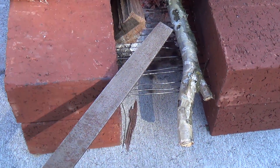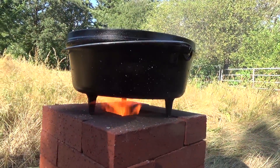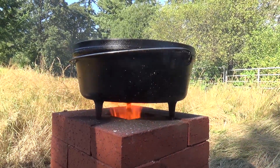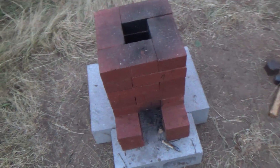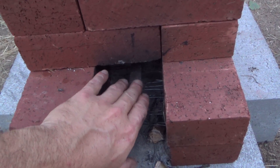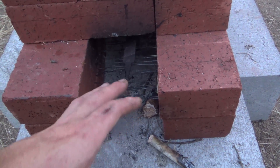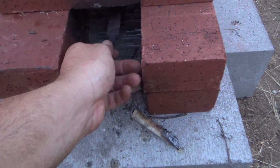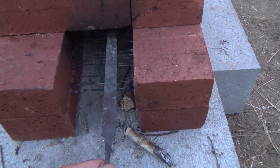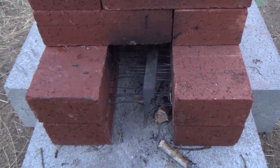The rocket stove is going and I'm going to see if I can get this file hot enough to forge. This worked really well as a stove, but it didn't work so well as a forge. I think part of the problem was the separation between the hot coals that fell through the bottom and the burning wood. I'm going to take that out and try again. The file was getting red hot — not quite to forging temperature, but getting close — so I'm going to try that again and see if it works.